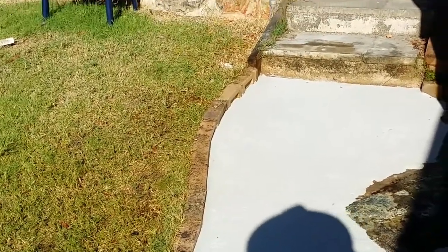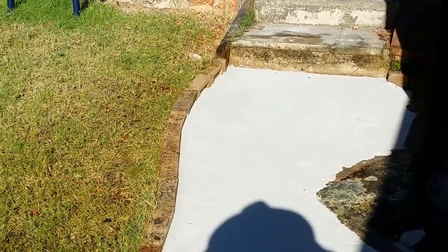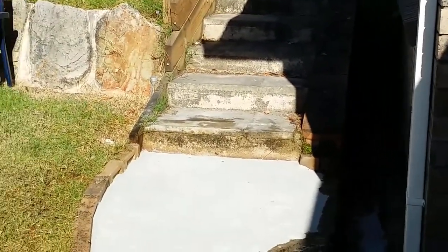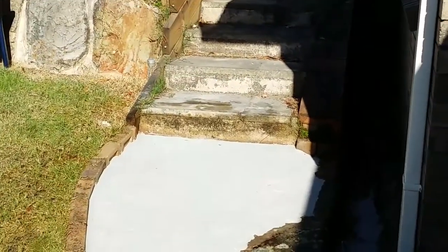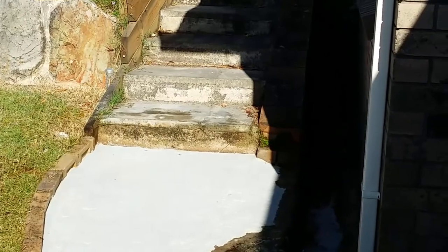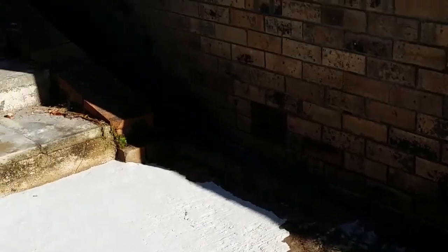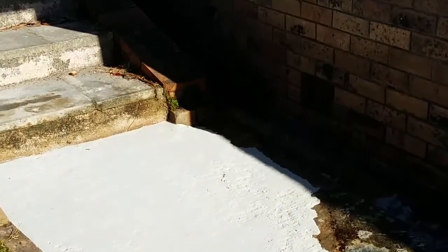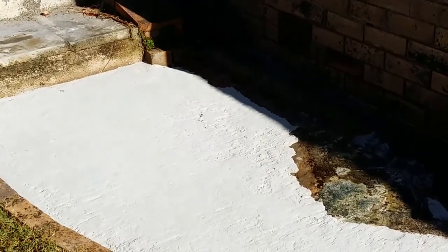This path was mixed up similar to a screed, a bathroom screed, so it was mixed up fairly dry and just laid down. As it dried, I ran a broom diagonally across it, and that's why it's not smooth. It's an outside path, and moss and dirt gets on it, and it needs some grip, so I mix up some cement and just apply it by hand, and that's what I do to get grip on a path. The path has to be clean. You can hose it off if it's new, or you can get a high pressure cleaner and clean it up.